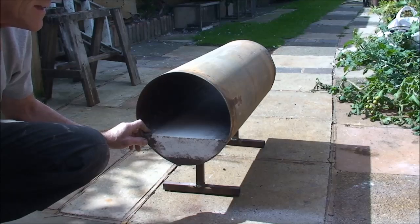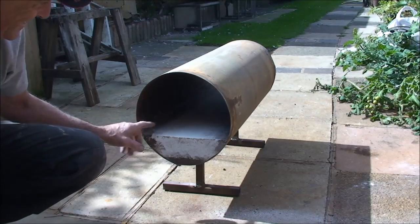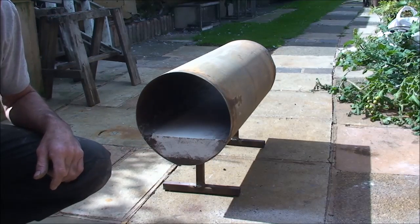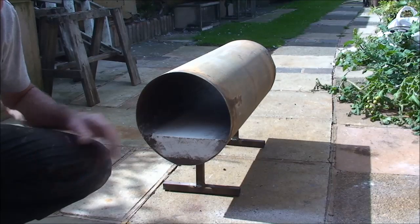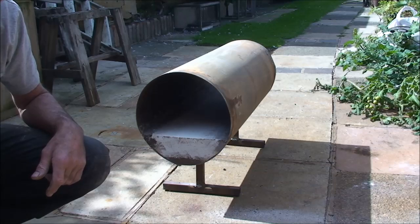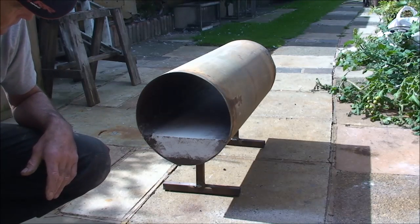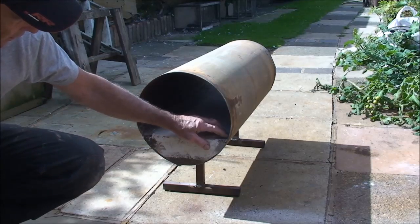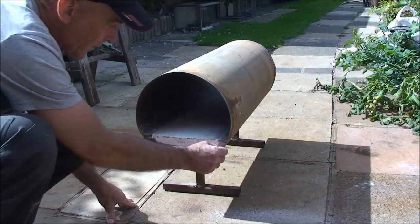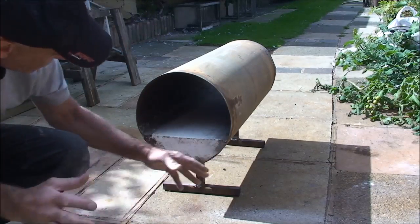...and some water glass — sodium something-or-other, yeah, water glass — mixed in. I also put some sandblasting grit in, aluminium oxide; I mixed all of them together. That should bake quite hard when the burner goes in. I put the blow lamp on it last night and it has baked hard enough just to hold them all in place and stop them moving around.